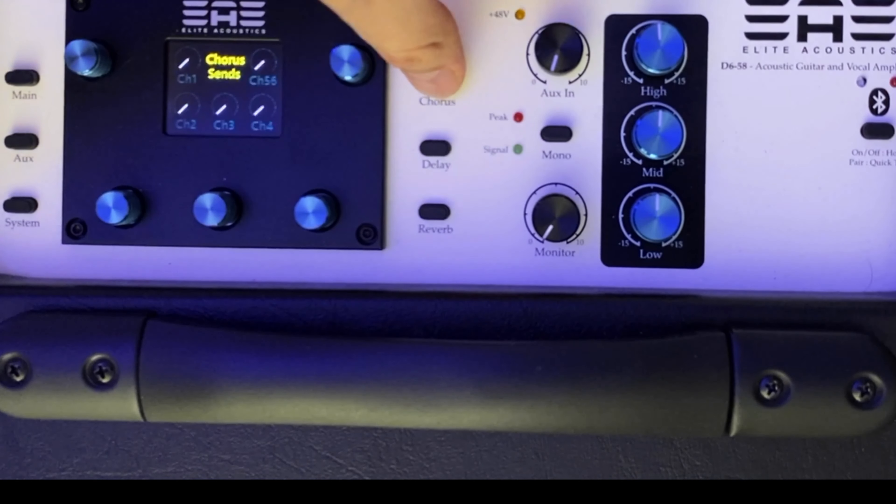So this is where I'm at - I've shaped my sound to sound exactly how I want it. I can send this to the front of house, and I can also hear it on stage. You can easily adjust that on the amp like I just showed you, or just reach over and use the high control. Here's the great thing I love about this amp - you've also got the three band EQ for the amp itself. So the direct sound won't be affected - you send that XLR out to the sound engineer at the gig and they have an unaffected sound to mix. But on stage you can use these controls to shape the amp with another high, mid and low. I love the fact this is a hybrid with the benefits of digital and the benefits of the controls on the amp.